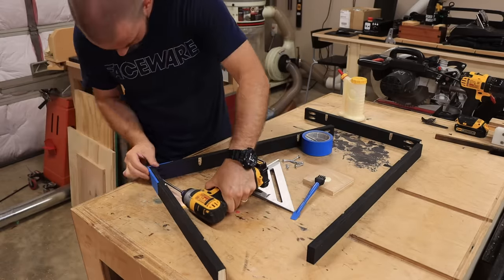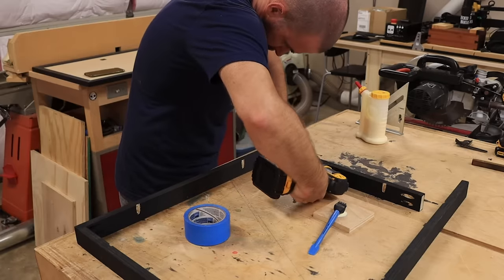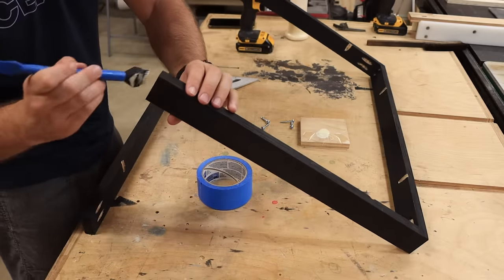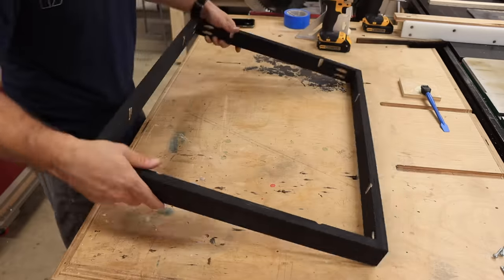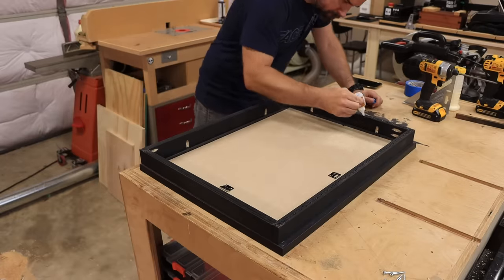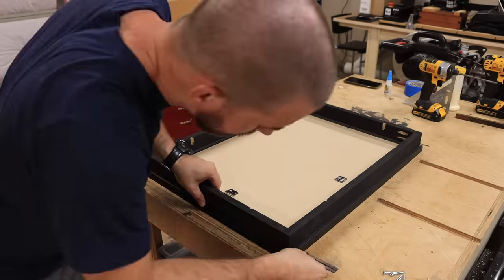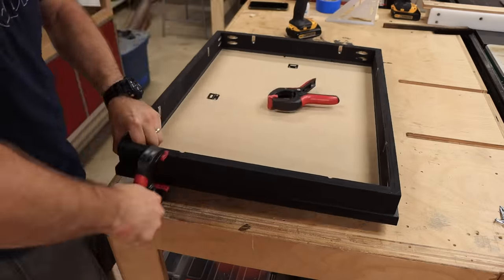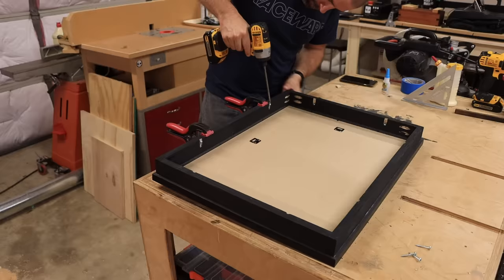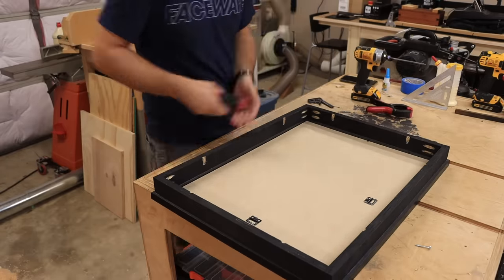The links in the description have special self-tapping wood screws that go into the wood really easily and help things stay aligned. Once the frame is assembled, we attach it to the back of the picture frame using a thick bead of superglue around the wood frame we built. Work quickly because superglue dries fast, but it creates a really strong hold. In addition to the superglue, we put two screws in each side. This is a great time to use clamps if you have them.